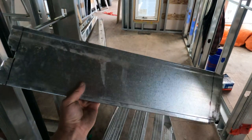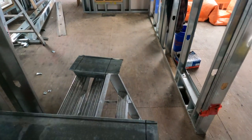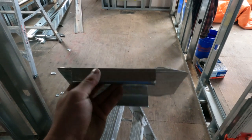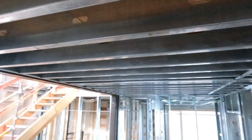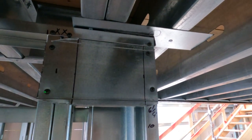So these are wall clips. I use stud on my wall clips and all I'm doing is cutting an inch and a half tabs on either end here. That's an inch and a half because I'm going to go across two studs. You see where I'm putting it in between the studs — that's for my bulkhead to catch right there. That's where I'm going to put my little studs to catch the bottom track.